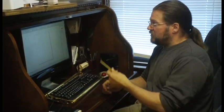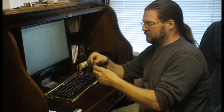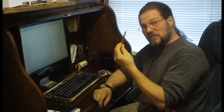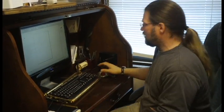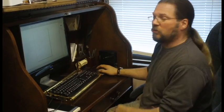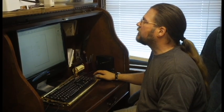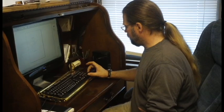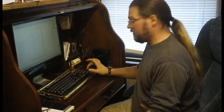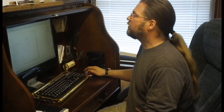I'm going to design my cannon on the computer so it has a nice look to it. This is exactly three and a half inches instead of four, but I'll still work with it. So first I'm going to make a rectangle in whatever program you're using — I'm using CorelDraw — and I'm going to make it three-eighths of an inch wide: 0.375, that's what three-eighths of an inch is, by three and a half.